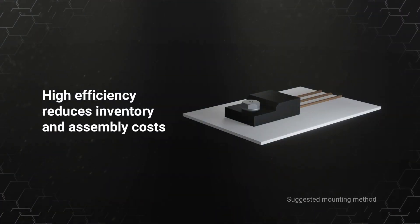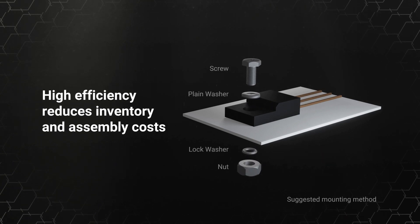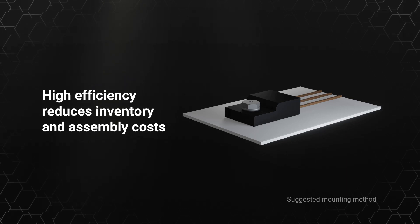The SIP3 package is pin compatible with the TO220 package used with 78 series linear regulators. While these are commonly used for their low cost and simplicity, they're inefficient and require additional components that the R78K series doesn't require. Using the R78K series regulator modules can actually result in a lower total system cost. The efficiency reduces the input current requirement, allowing for a smaller, lower cost primary power supply. It also reduces inventory and assembly costs, eliminating the size, weight, and cost of the heat sink, mounting screw, nut, and other items needed with a 78 series linear regulator.